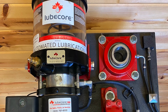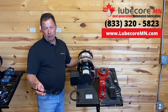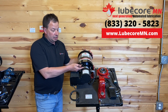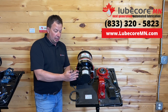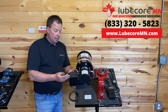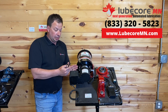It's a very visible, distinct line to show you where the grease level is. The pump itself is constructed of a lot of aluminum and stainless steel, which in Minnesota's environment — with heat and cold, road salt, road grime — can be very corrosive on pump components. The electronic circuitry itself is potted in silicone behind a plastic cover, and the reason that's important is that water and dirt can otherwise ingress into the electronic circuitry.